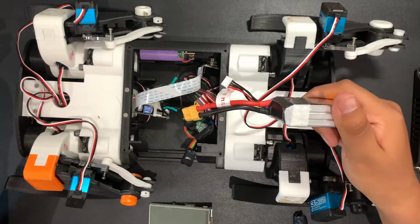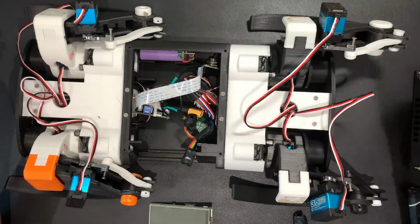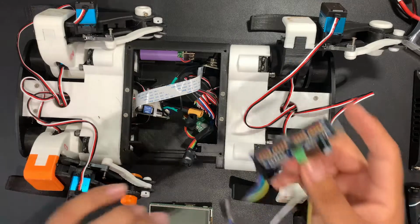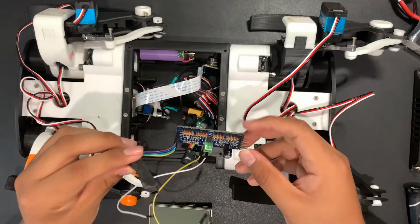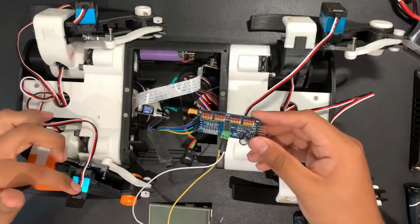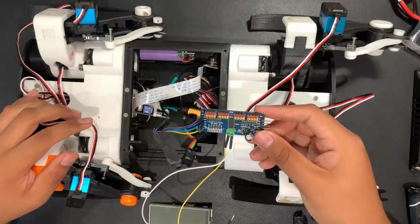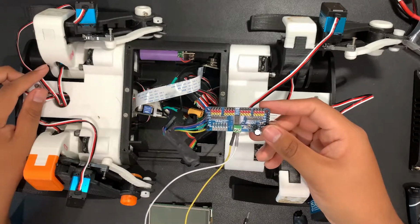I had an issue where I had either too much voltage or too little. Basically, at one point, the whole thing was powered by a 5-volt supply, and that's enough for the servos to work, but not at their full capacity, and so the robot couldn't stand with all its weight. Hopefully now it will stand. I haven't really checked yet, but ideally it should be able to stand. We'll have to see if they walk though. I haven't tested that yet.